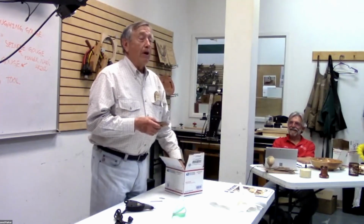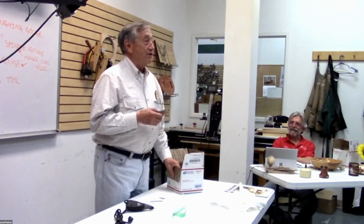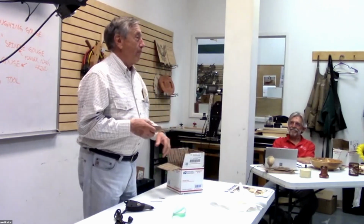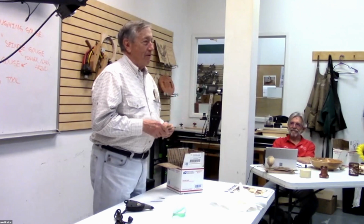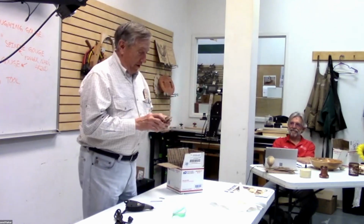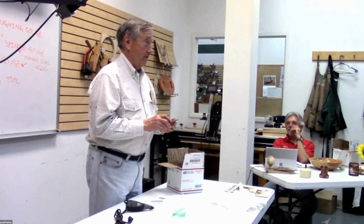In American Woodturner, there was an article about drying bowls using desiccant. And it said you can take a bowl and put it in silica desiccant, and 3 days later it's dry. Well, on April the 7th, it weighed 505 grams. On April the 11th, it weighed 408 grams. I couldn't believe it. And it didn't distort.